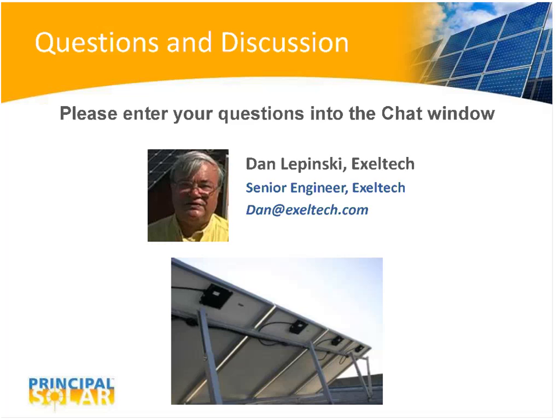Well, the advantages to the electrolytics is they are smaller and they are lower cost than alternate components that will do the same job. But again, we test these units, for example. Somebody said, well, how hot are your units designed to handle? We specify them for normal operation up to 70 degrees C, which is about 156 Fahrenheit. We actually test them to 90 C. That's almost as hot as my attic here in Dallas in the summer.